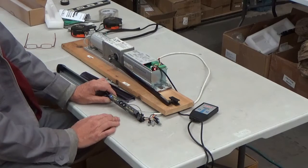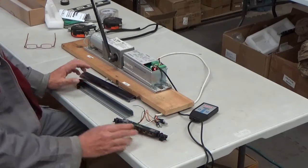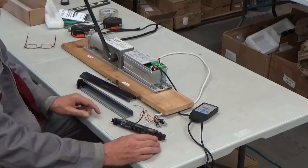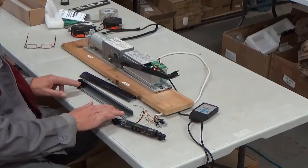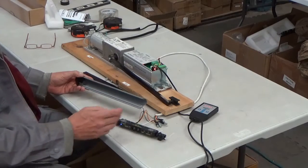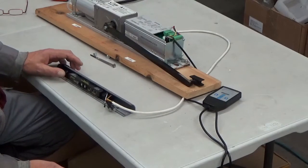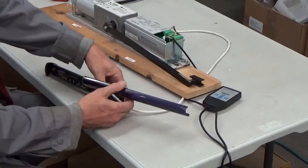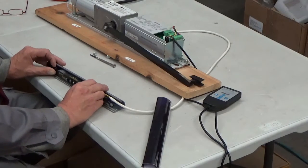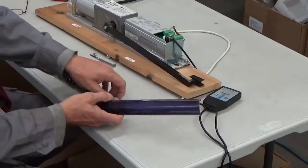You want to get this wired and put together before you put it on the door, because if you mount the channel first, the screw heads won't allow you to slide the lens onto the track. Once the main component is mounted on the door and the range is correct, it's adjustable with these screws, and you can adjust the angle somewhat by loosening those thumb screws.